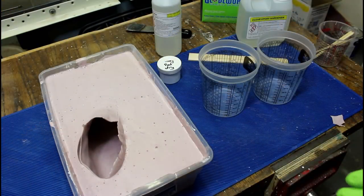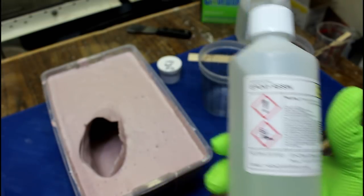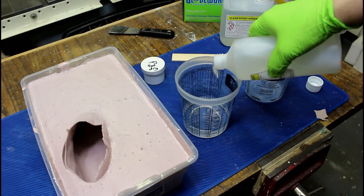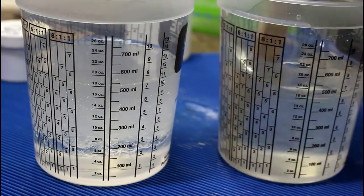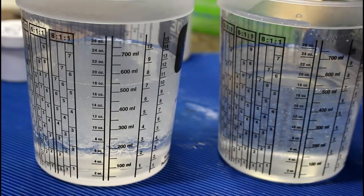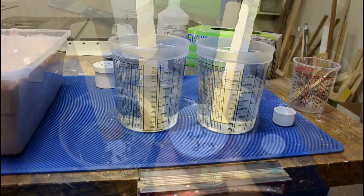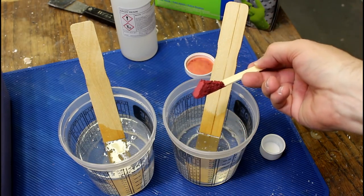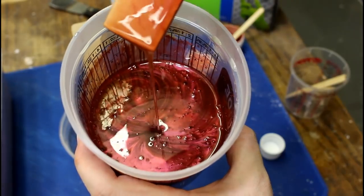What we need to do now is fill this with resin. I roughly need around 38 ounces of resin. I'm using a brand new resin — clear casting epoxy resin from a company called Chem Resin. This resin is mixed in a two-to-one ratio, so I'll do 12 ounces of resin and six ounces of hardener, which will put me at 18 ounces in each of my cups. We stir until it goes clear — and that goes incredibly clear. Today we're going to use some of my powders, the Shiny Red. I've used this before, I know you guys like it. Seems to take it pretty well, actually.